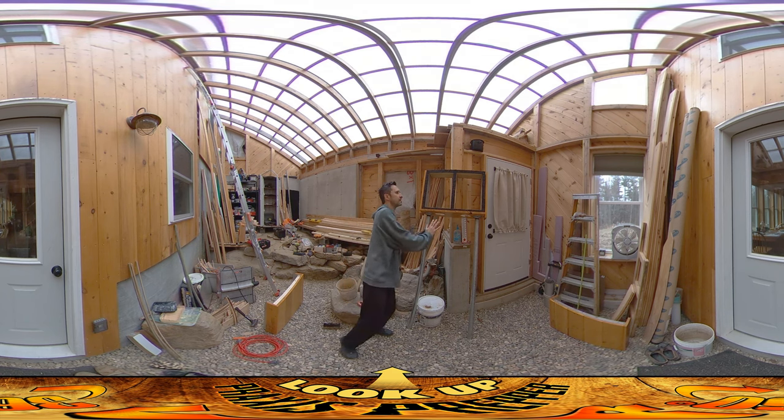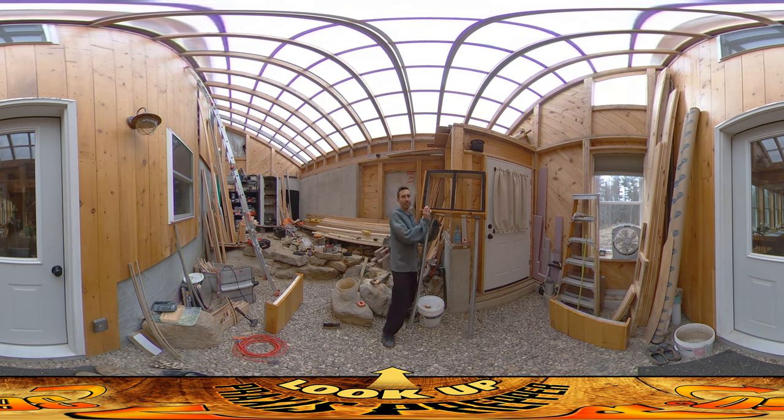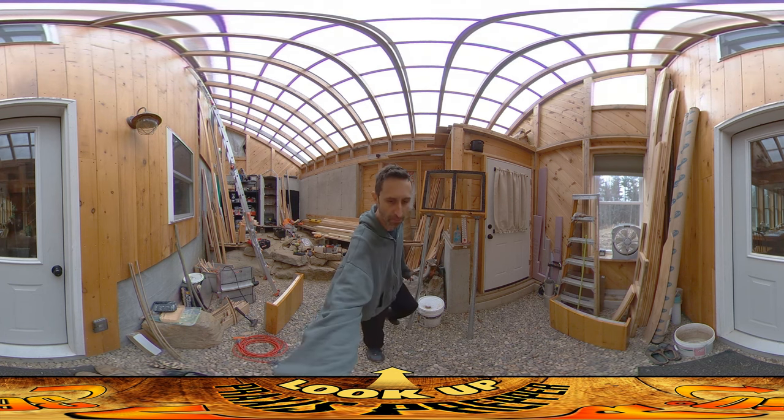So 60 square inches of space to bring air in, and each tube has 12 square inches to draw down. That was important — I wanted to make sure I didn't create a limiting factor by having the air intakes be smaller than the vent tubes themselves. This is ongoing; I'll be working on that in a bit.